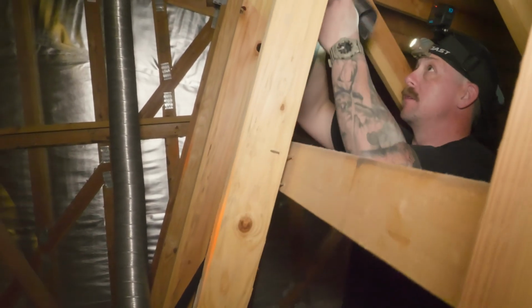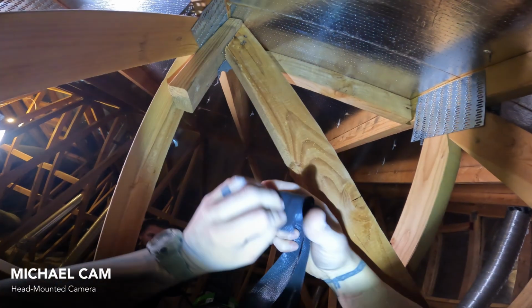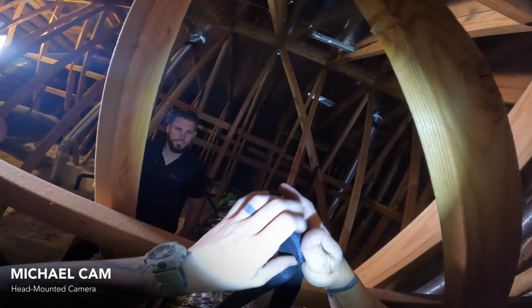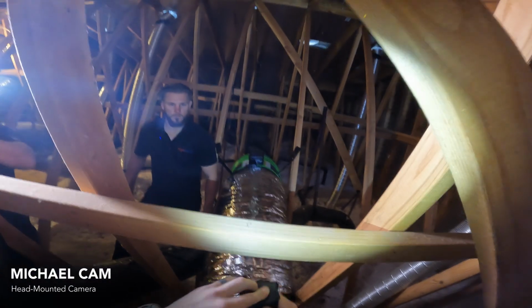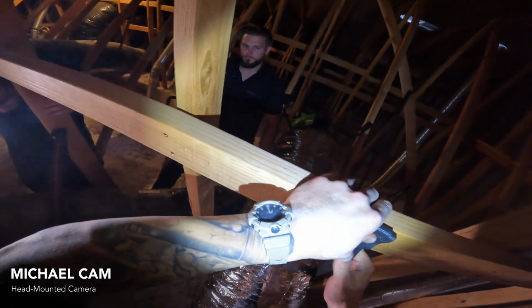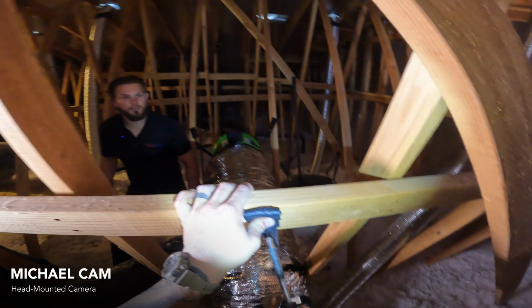All these straps are universal between all of our fans, so you will have some excess on these shorter ducts or smaller ducts. Is that something we tie together or use a screw in the attic for? Well, I'm going to roll up some of the excess, and then with the supplied screws that came in your accessory pack, you can shoot a screw right through it, and this just happens to be a very convenient place to hang it. And we'll support it just like that, just giving it a little bend in that duct. Looks just like the marketing photos. It's because I did those fans too.